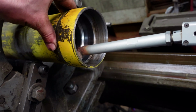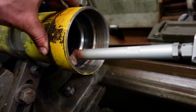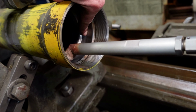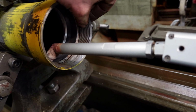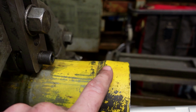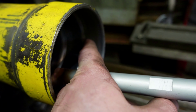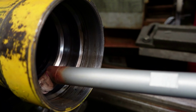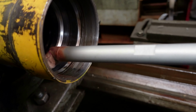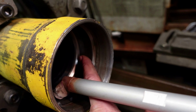And because the O-ring here isn't moving, it's a static O-ring just holding the gland, what we're going to do is weld up the bore and recut it back to dimension so that the O-ring will be able to seal again. The threads, surprisingly, are actually in pretty good shape. I think the last couple are a little stretched, but up about 3/4 of them from the mouth are pretty good, and the last couple aren't even that bad. They're good enough to hold the gland for this job.